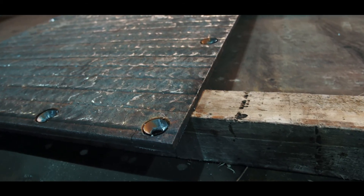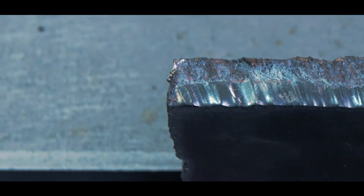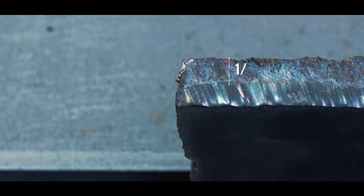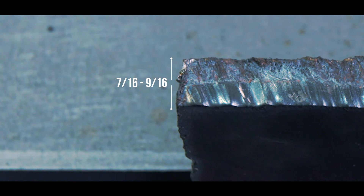This is how we measure the total thickness of a finished Clifclad plate, with an overall tolerance of plus or minus a sixteenth of an inch. For example, a half-inch nominal plate is typically a quarter-inch of overlay applied to a quarter-inch base plate. The end result will be a plate that ranges between seven-sixteenths and nine-sixteenths thick, hence half-inch nominal thickness.